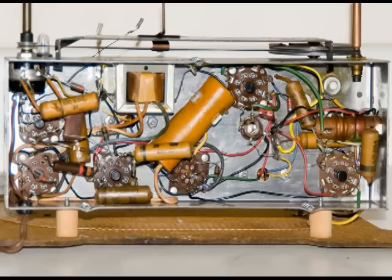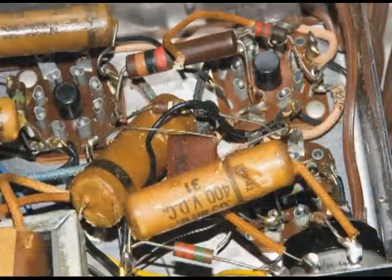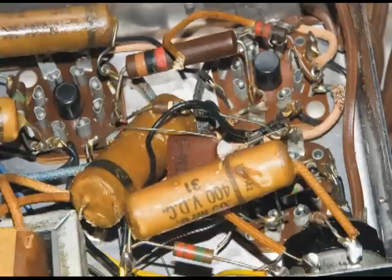All the coils were good, so I've started replacing the wax capacitors, and I like to start with the toughest ones first. Here I'm in the midst of wiggling this large capacitor out from underneath all this wiring, and here's the ends of the capacitor, and I'll just attach the new capacitor to those ends. I do this because it's much less stress and much less likelihood that I'll break something like a tube socket doing it this way.